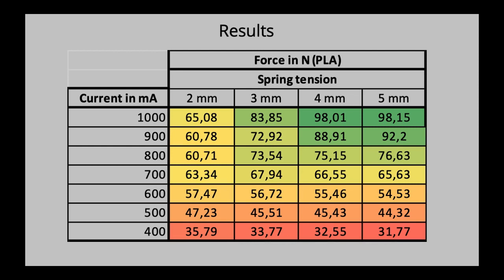And I thought about that problem, and soon it dawned on me that as you increase the spring tension, the spur gears on the hob gears, or the dual drive gears, are meshed closer and forced together harder, and that creates more friction inside the gears, which has to be overcome first of all. So you lose some torque to that friction, and that's why these numbers actually go down. That is the most likely explanation I could find for that phenomenon.